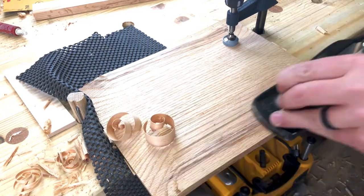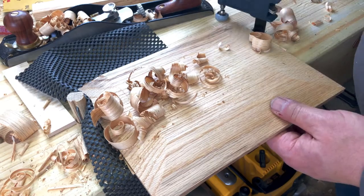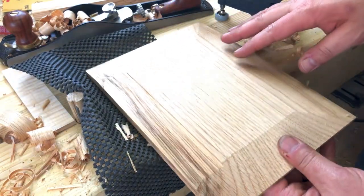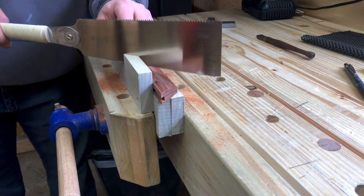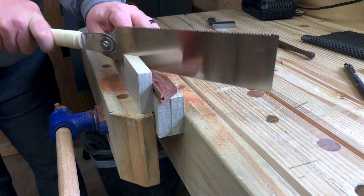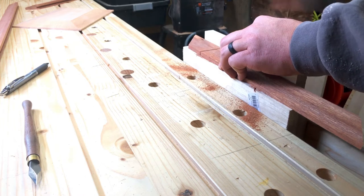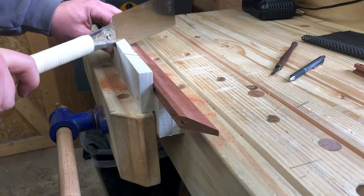This is actually pretty fun but pretty tricky - trying to get the lines from each corner to match up perfectly at 45 degrees going into the corner without taking too much off. This is the first time I've ever done it with a hand plane and it came out pretty well. Now I'm turning my attention to actually cutting the 45 degree miters for the picture frame border. I used my Japanese pull saw and a homemade poor man's miter box - Paul Sellers has a decent video on how to make this. It's really simple and effective and fairly accurate.